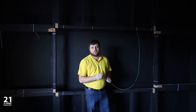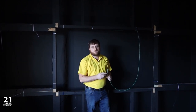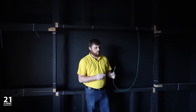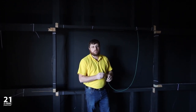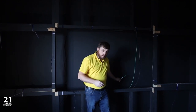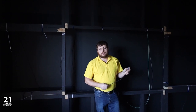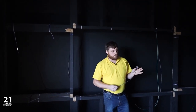We also have an Ethernet cable for IR control. We're doing a Control4 system, and this TV does have IP control, but just in case, we always like to have a redundant system available using network cable to the back of the room to do IR control. We also have our HD Anywhere optical HDMI cable rated to 48 gigabits. This will ensure that we can get full 4K video at any frame rate that the client is going to be watching.